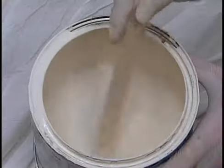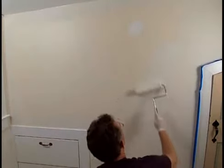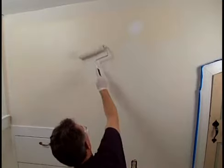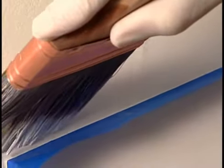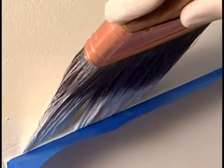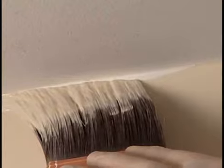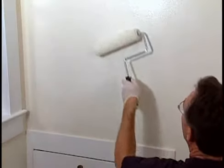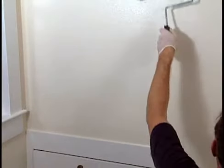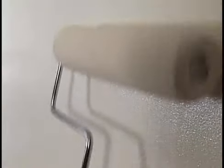And now it's time to paint the room. Apply the paint smoothly with a roller, starting first by making a W and then spreading the paint evenly across the wall. Edges are cut in with a good quality brush, sweeping the brush up to the edge. With practice, you'll end up using a lot less masking tape. Depending on the wall and the color you're covering, you may require a second finish coat, but the result will have a smooth, even professional finish.